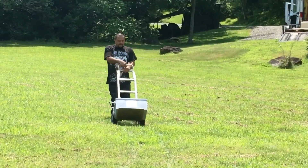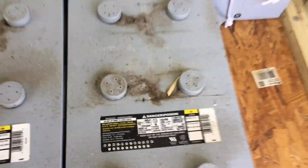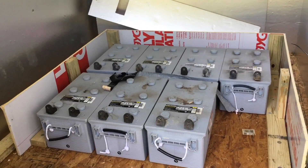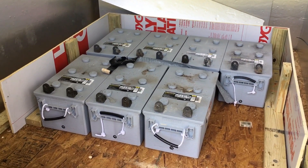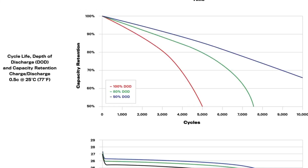And there they go, folks — lead is dead in most applications. We're pulling out these big boys. These were 225 amp-hour at a 20-hour rate, so this guy basically had a 450 amp-hour 48-volt battery bank. I'll show you the math on that compared to lithium. Looking at the spec sheet for cycle life versus depth of discharge — if you are cycling to 50 percent you can only do it about 1,000 times, which is roughly three years. So you're going to kill this battery pretty quick, which is exactly what happened. Now on the Arc spec sheet, at 100 percent depth of discharge you get 5,000 cycles. At 80 percent depth of discharge you get somewhere around 7,500 cycles. At 50 percent depth of discharge it goes right off the chart. So you get a lot more power.